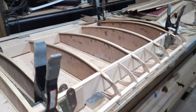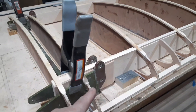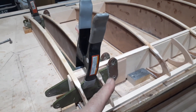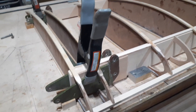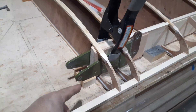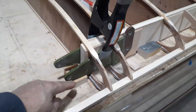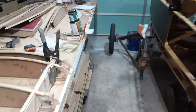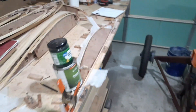For you sharp individuals that caught this — these strut brackets and spar mounting brackets are in backwards and upside down. One, because my positioning blocks are in the way, and two, it's just for spacing to get the proper spacing for the compression struts. The last of the 53rd rib is on the table here being glued.